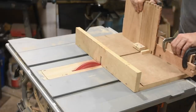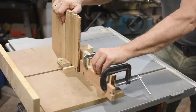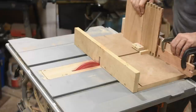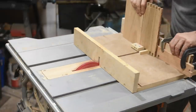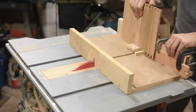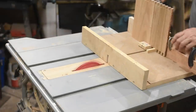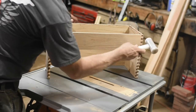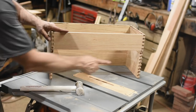I should mention that I made a rookie mistake by not screwing the little jig to the face of the sled — I just clamped the heck out of it and figured that'd be fine. But on my final series of cuts it slipped, probably just a couple thousandths of an inch, but that was enough so that one corner of the box didn't fit all that great. I was able to compensate — backfill, chisel out a little bit — and eventually got it to work, but it created a lot of extra work, and a careful examination of that one joint would show it was, shall we say, less than beautiful.